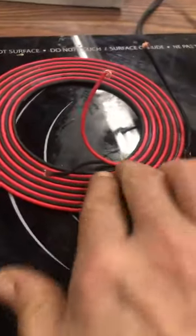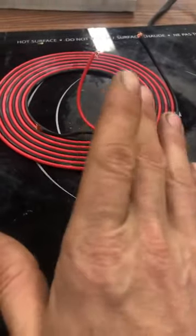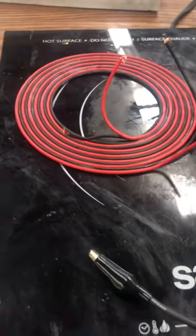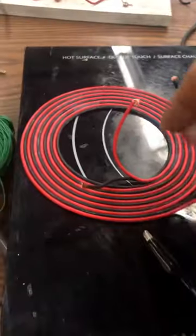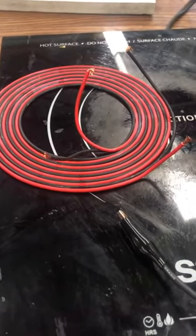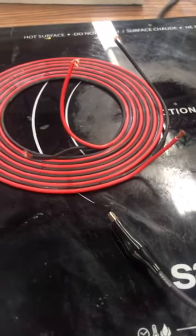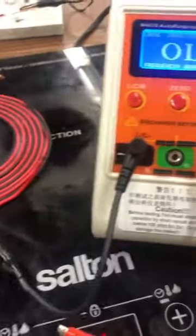The fundamental frequencies of these coils are much higher than what they're being driven at, and that's not a big deal because these are resonant. I built larger ones that were resonant — say 2.4 megahertz was a fundamental resonant frequency as tested on an oscilloscope with a signal generator. It was a much larger coil, but the thing was it had a wide-band resonance, meaning it was in resonance all the way from about 1,000 Hertz to 2.5 megahertz.